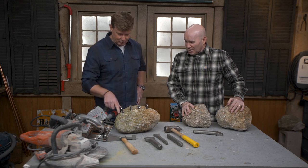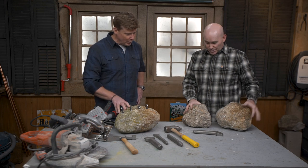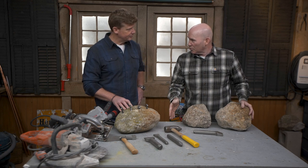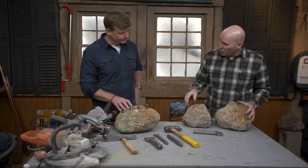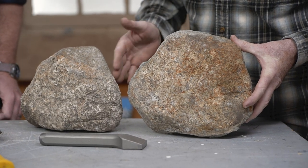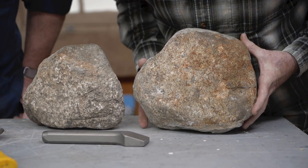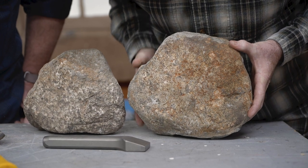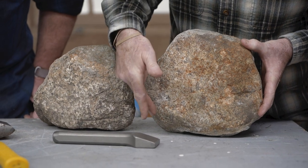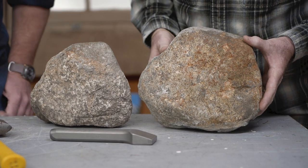This is real old school, too — this is for splitting? This will split that rock right in half. Feather and wedge, which we've done. What are we doing today? You want to show me how to whack, or you want to show me how to cut, or both? Well, we've done this so we know the result, but what I do want to show you is the cut, the clean cut that a saw is going to make. As a stonemason, I like to see my joint between the stones — three-eighths of an inch, max three-quarters of an inch. And you can see if I bring these two stones together, I'll get my three-eighths right there, but I got a little gap right here. Too much. So if I take my saw and cut that, I'll be able to bring it closer from the bottom to the top. So, let's do some cutting.